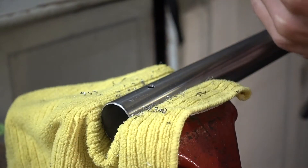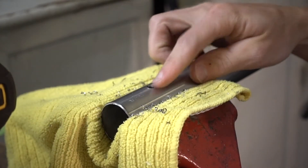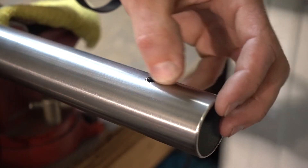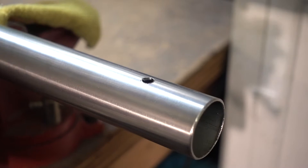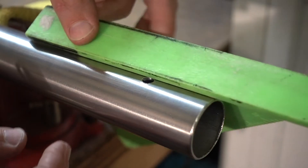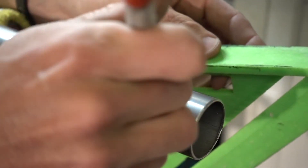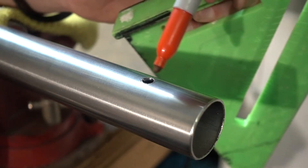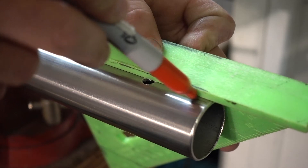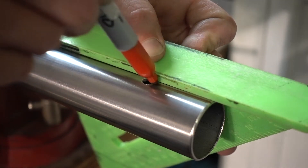We're approaching the last size — do not go bigger than size one-fourth. Our slit hole is complete. Before we move the bars to the saw, let's draw a line as a guide path so we know where the blade needs to go. The easiest way is to take a right angle, put the lip on the side of the bars, and draw a nice thick straight line. Drawing a straight line on a circle by hand is really hard, so using a right angle gives us a perfect guide for cutting.